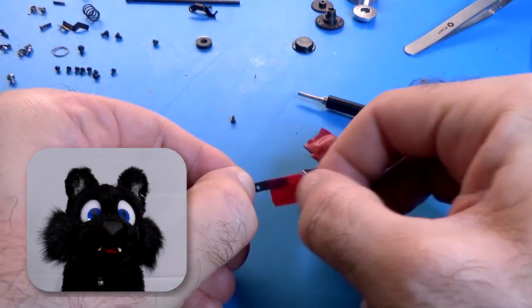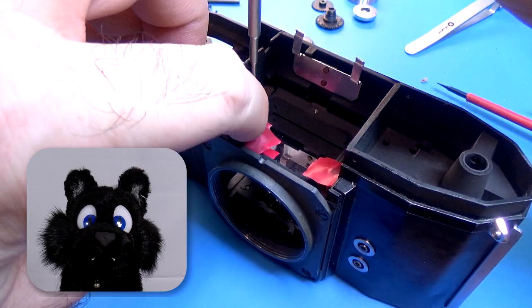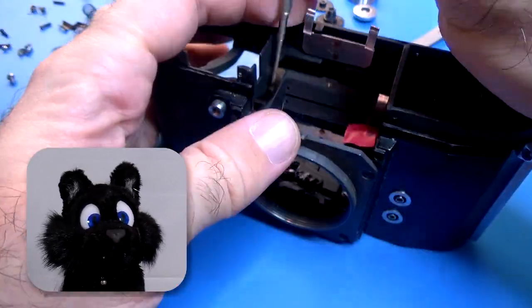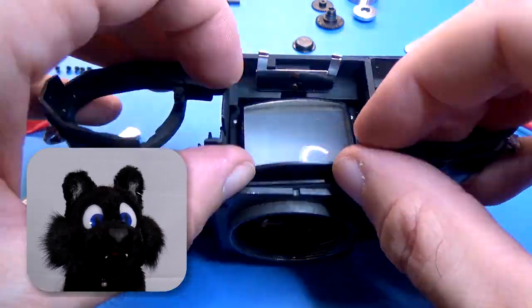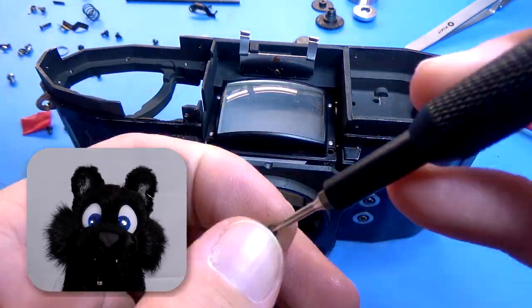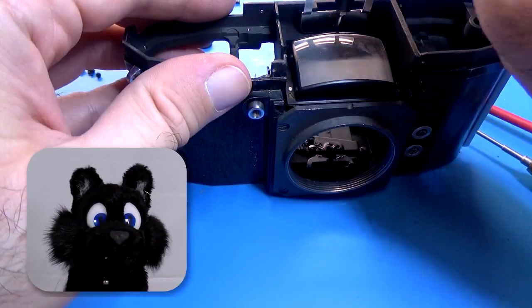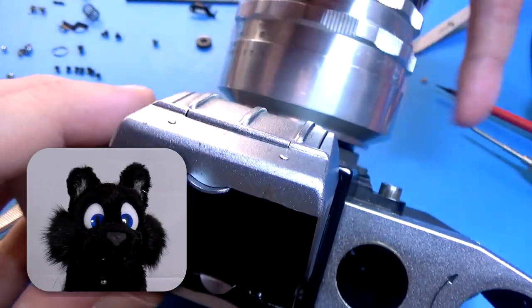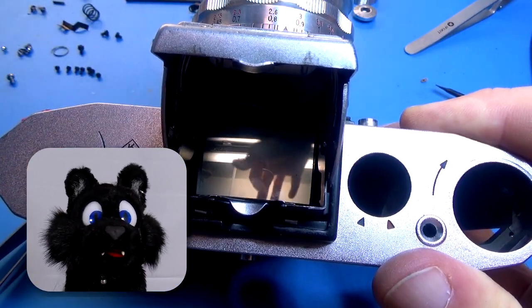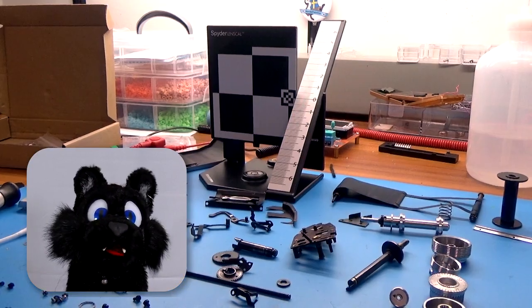The viewfinder took a bit more work. Naturally, I wanted to know how in focus my images would be. So I had to make sure that what the lens projects to the film matches what's visible on the focusing screen. I used some plastic wrap as a film substitute again, focusing on a target to verify that the lens distance markers make sense. Then I flipped down the mirror and adjusted the focusing screen to match. This had to be done in semi-darkness, so there is no video of it. Sorry.